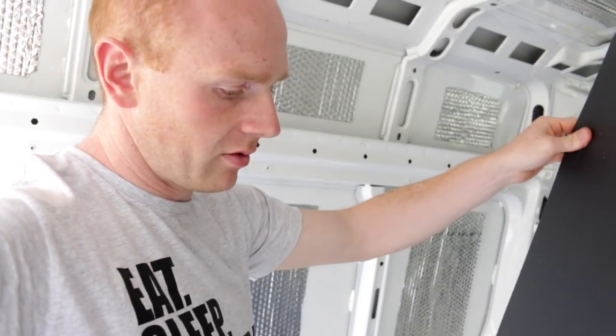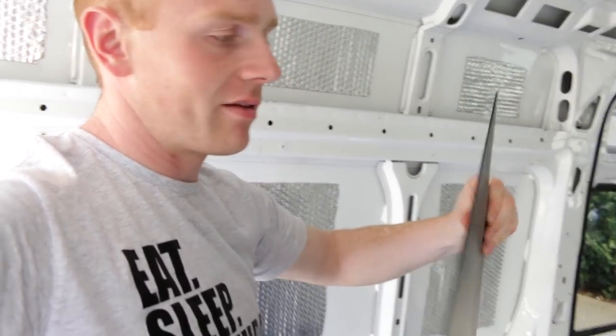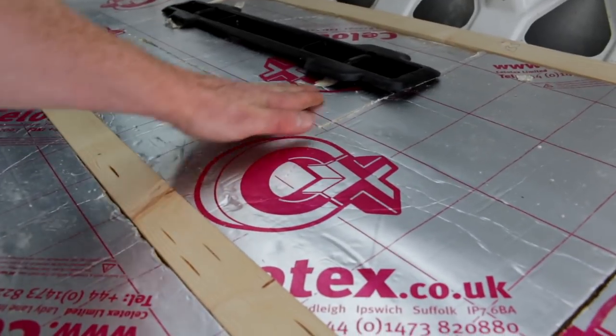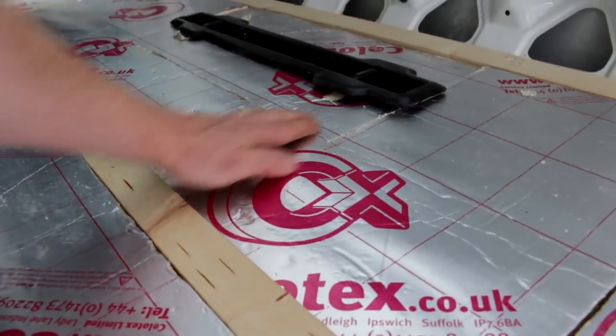We've just been down to pick up some of this surface templating material. So it's thinner, we can slide it under, and it's gonna be more accurate to cut and scribe to the walls, and then we'll transfer this onto the plywood. Now I need to start sliding some template material underneath here.